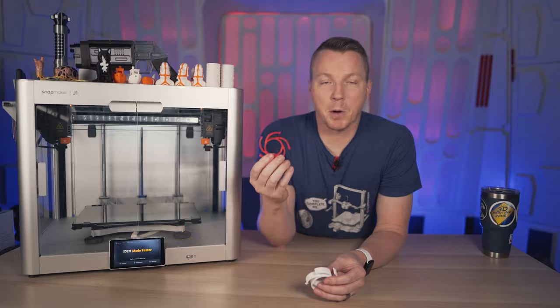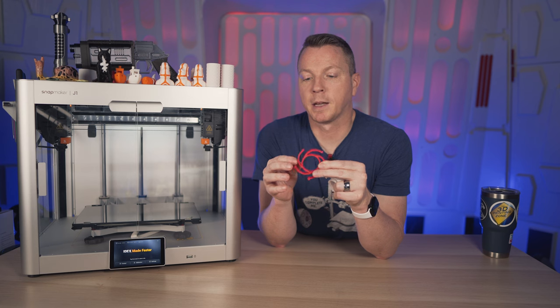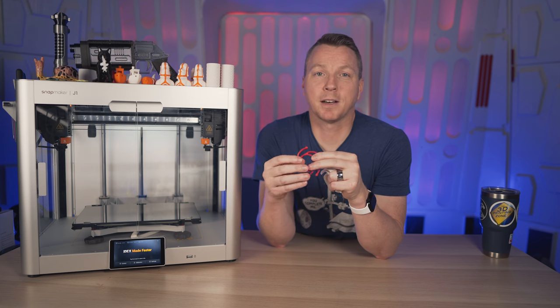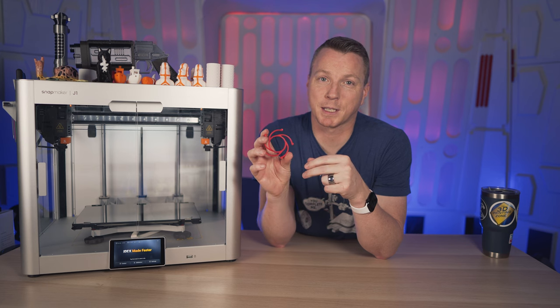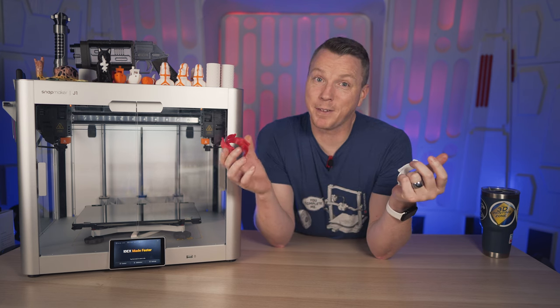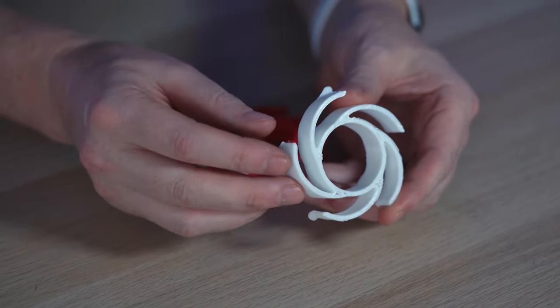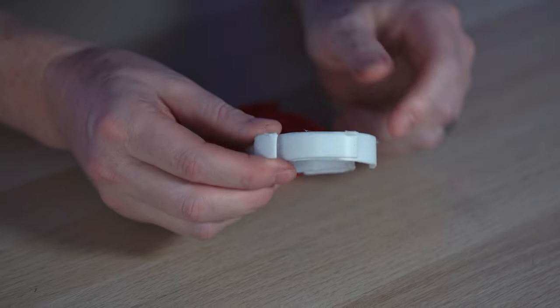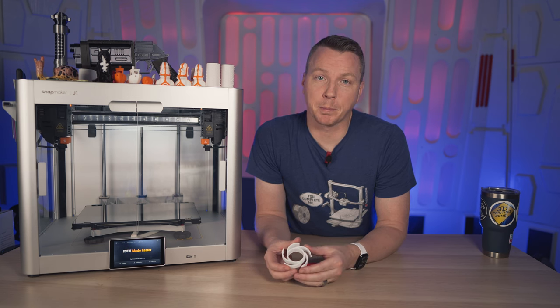The red part on the other hand came out all in one piece looking pretty nice. This is not the most high quality thing I've ever seen — not equivalent to a really slow moving, intricate, detailed part — but that's not what I needed. I just needed something basic that was going to do the job and ideally fast. The white one, despite a pretty rough start, still did complete. I had to cut off some stringing, there was a little bit of warping on the bottom, but for a functional basic print it did just what I needed, and it did it super fast.